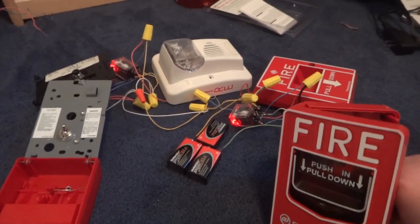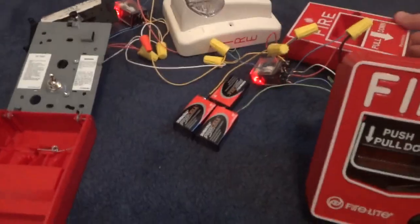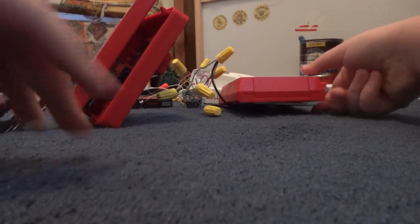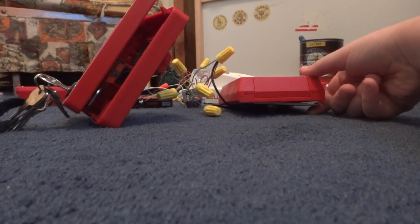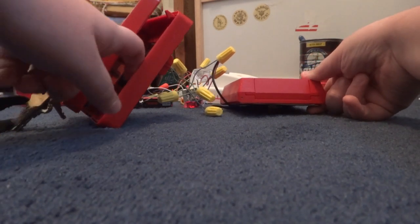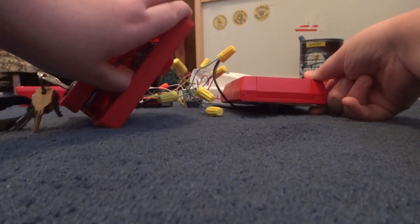For a silent drill, you just lift this switch up and press the drill button — the strobes will flash for fire drill. For a silent walk test, you'd leave that switch up, press the drill switch, and the strobes are flashing. Then it backs up and resets. That would also be a switch, but it has to be wired in differently.